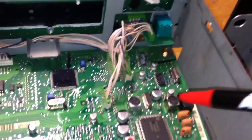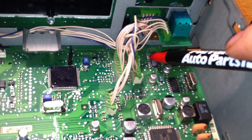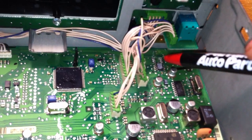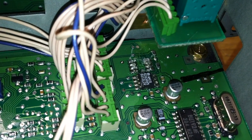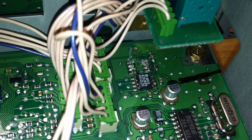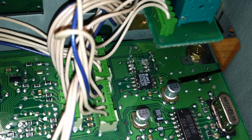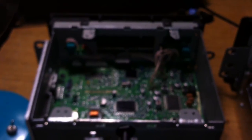I'll cover the older style since it's going to be more common. The chip you want to remove is back here, right here. A lot of people say remove pin 8, but you can just remove the chip entirely — it's easier that way. I didn't do a very graceful job of removing it but I didn't damage the board or the radio. You can see I scuffed the board up; this was my first attempt. All I did was remove the chip. If you want, you can remove the little board with the control knob, remove the wires, clean off the solder, but it doesn't really matter — the radio will still work.